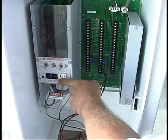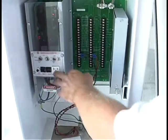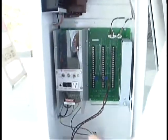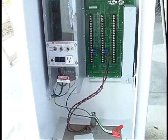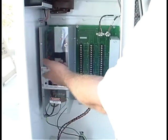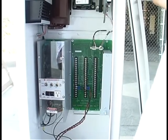There's a courtesy outlet here. If somebody needs to be working around here, it's not recommended other than for servicing the gate. The gate is in the on position — manually raise it and turn the power off. Now it's up for good until they're ready to put it in operation. Then you will turn the power on and put it in automatic. Raise it, turn it off, and it's good to go until they're ready to put it in operation.